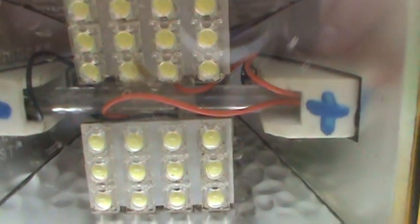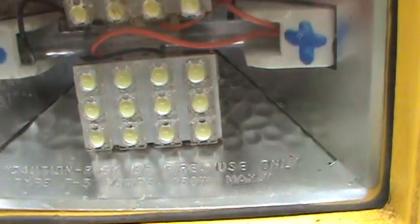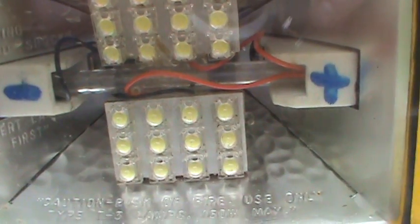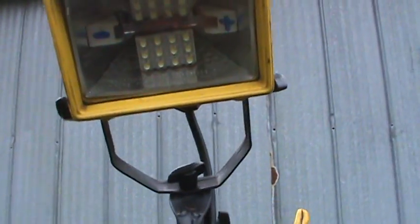Even the light itself — you can see here I just used a piece of pen, a plastic pen. I cut a piece off the right length, stuck it on there, and mounted the LEDs to it. I marked my poles positive and negative just to make it easier when I hooked it up. So if I have to, I just pull the pen out like a regular light bulb — like a halogen long skinny light would be in there — put the halogen light back in, unsolder the wires, and plug it in so I can use it as a 110 volt light if I have to.